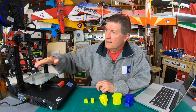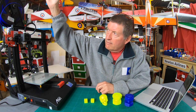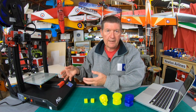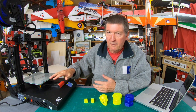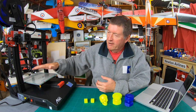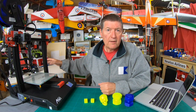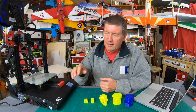At the start of the next print, the z-axis would go right up to the top to home, then right back down again, which gave the chance of the filament looping off the spool. So you could never just set the printer going and walk away — you had to wait until it heated up and started to make sure it was working okay. The other issue was that the printer bed at the finish of each print would go all the way back, as if hiding the print, when I wanted it to either stay put or come forward to present the print. These are things the Ender 3 handles better, so I looked at the Ender 3 start and end G-code and made some changes for the ET4.